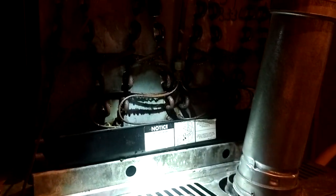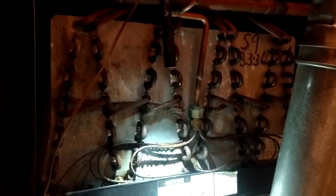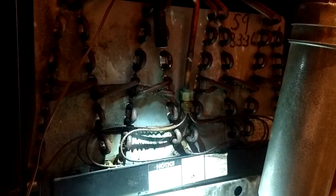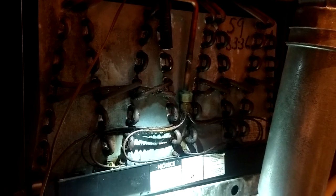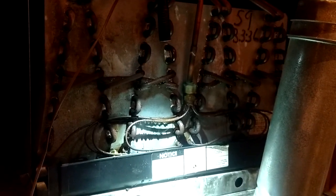All right, how's it going? I've been sick as a dog the last couple of weeks and my voice is about gone. Hopefully you can understand me. I'm out here working on an old HVAC unit — this thing is old as the hills. When I got here, I was only at about 40 PSI outside on R22, so we're pretty darn low.